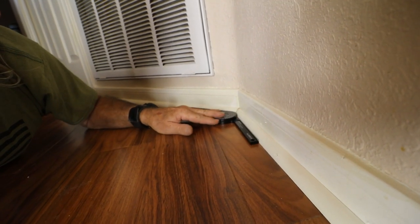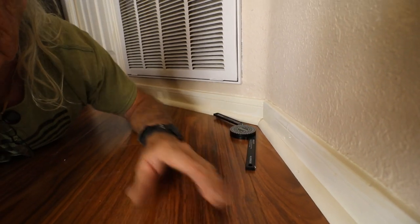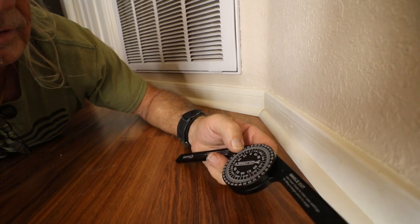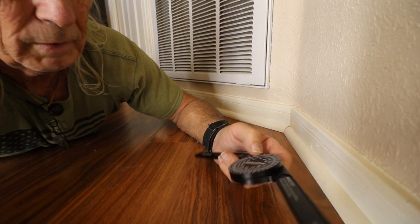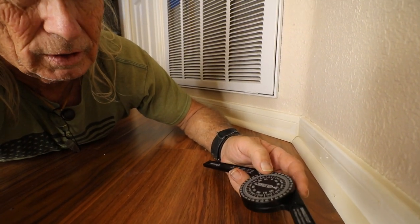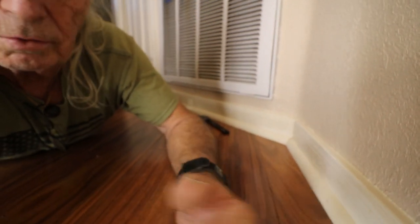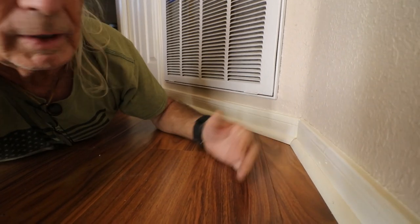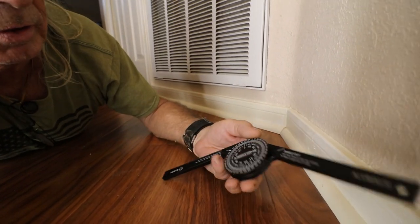Here I was running flooring and had to turn 45 degrees. I got the protractor up against the wall of the house and it wasn't 45 — it was off. The protractor showed 23.5 degrees. So when I cut these pieces, I set my saw to 23.5 degrees instead of a proper 22.5-degree split to make the turn.